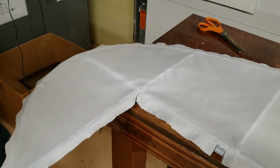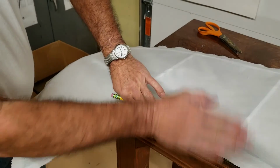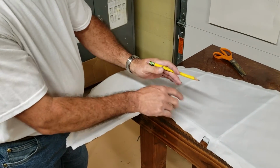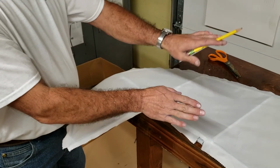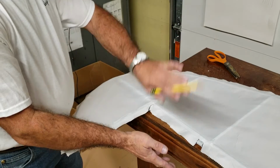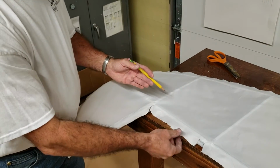There's times that we'll cover when you're doing a wing, and you're double covering over the leading edge, and you've got one fabric going to go over the other, and you really don't want to pink that whole edge because the other fabric's going to go over it, and before you put the second fabric on, you're going to take that iron and just really smooth that down.